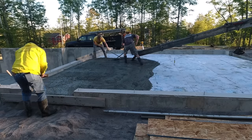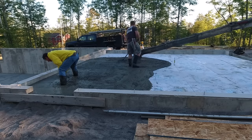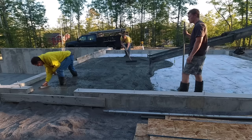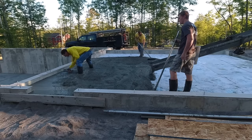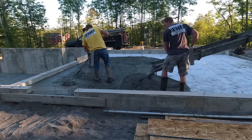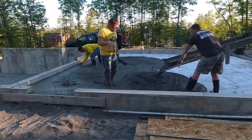Basically what the guys do is come in and pour the concrete walls, then come in to backfill — sometimes four feet of backfill, sometimes eight feet, depending on if they have a full foundation like the basement you see to the left. They backfill in lifts, like 12-inch or 18-inch lifts, and they compact it really hard so it's not going to settle. Because it's an inside pour, the dirt's not going to heave — it's not going to get below freezing inside the garage, especially with the styrofoam under there.